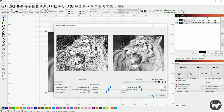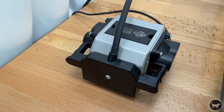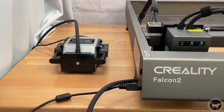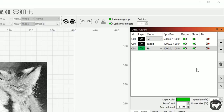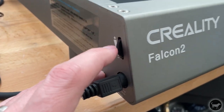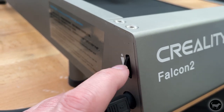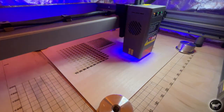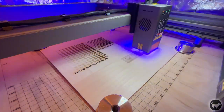One of the best and most exciting features of this machine that I have not seen on any of my other laser engravers so far has been the automatic and variable air assist. While I have seen other machines allow for turning off and on of the air assist, I have not seen one that allows you to adjust the airflow on the machine. On the side of the machine where the air assist hooks up, you will find a flow dial that lets you choose how much airflow is coming through. The function that really excites me is that the machine can change the airflow on the fly — when using a laser with an air assist, you never really want to completely turn the airflow all the way off since the smoke will suck up in the nozzle, make the lens dirty, reduce the power of the laser, and eventually damage the lens.